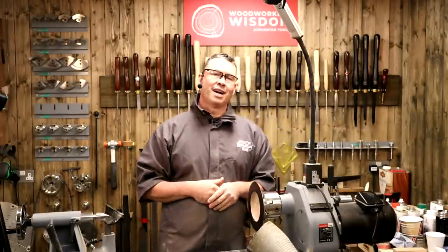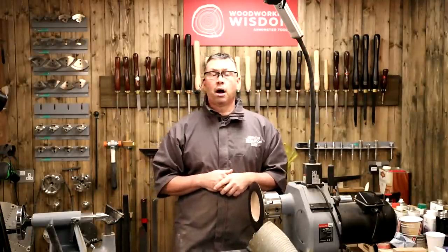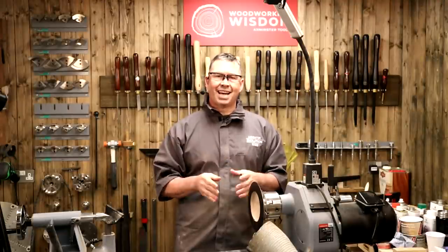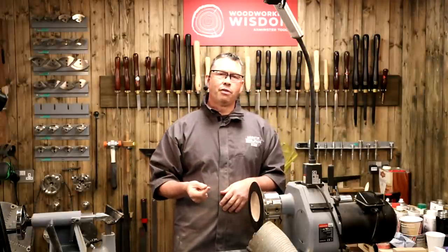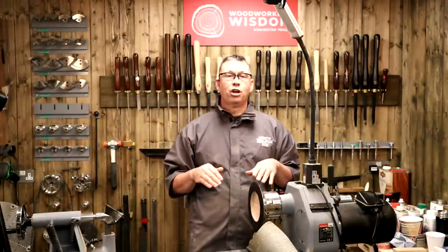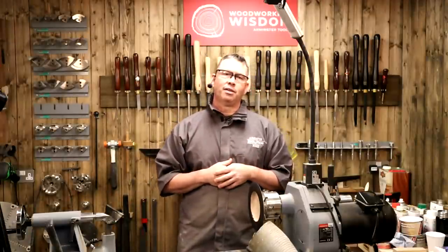But under a neutral wax, you have to have a sealer anyway. And so you're going to get a little bit of darkening. Your best bet, probably, I would lacquer. And this is a bold move, lacquer without sealer. So lacquer, allow the grain to rise, sand back. We're going to use the lacquer as a sealer. Then we're going to apply another coat, lacquer, very lightly denib, and then lacquer again. Generally, 3 to 4 coats of lacquer should do the job. Okay. But that would be probably the palest way of doing it that you could get.